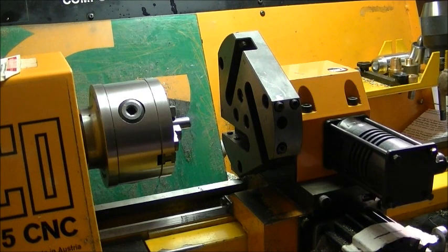So, just to recap, to manually test, switch the machine into hand control, press and hold the forward button and press the numeral for the number of tool positions you want the tool holder to rotate. Quite straightforward. Thanks for watching.